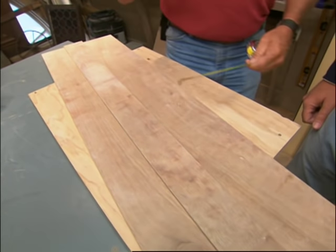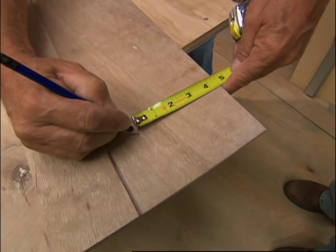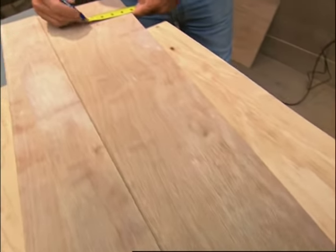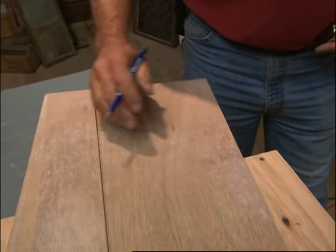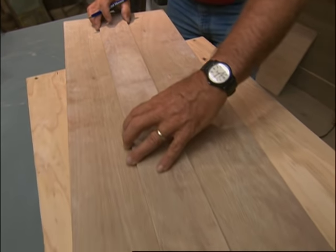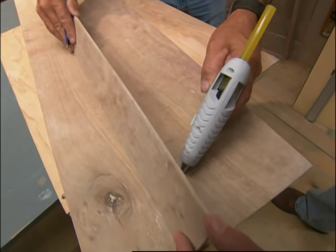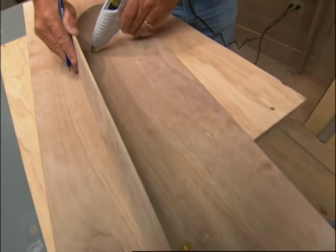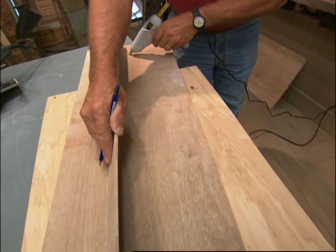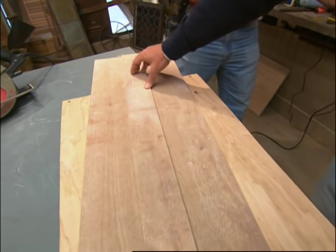The offset of the saw was four inches on one side. I'm going to mark four and a half on this side, four and a half on this side. Why a little further? I want to have a little bit of waste. As I run my straight edge, I put it on the two lines, tip this up, and now you can use some yellow glue — I'm going to use some hot glue. Dab of hot glue here, here, and here. Push it down, give it a second to set.